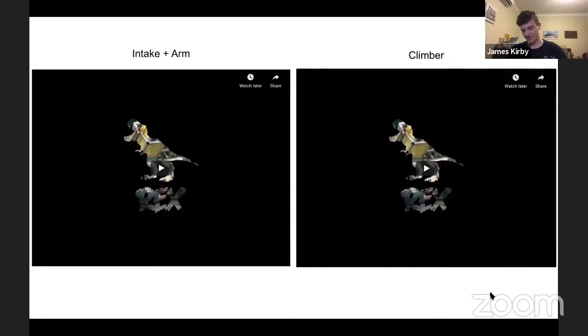So that one obviously is a mechanism of ropes and pulleys. That's a cascading style climber because all the stages go down at the same time. You can do something similar using the tubes that I described before. If you don't want it to be load bearing, using PVC pipe within each other and just ropes running inside and some low friction blocks, nylon or something similar, can allow you to extend very high, place a hook that is then released and then used to winch yourself up.